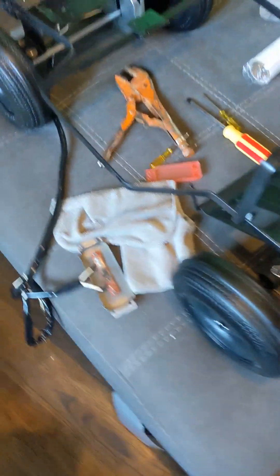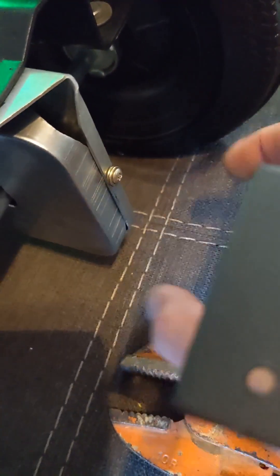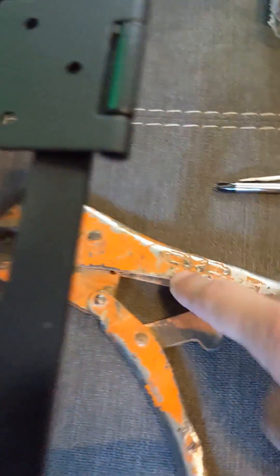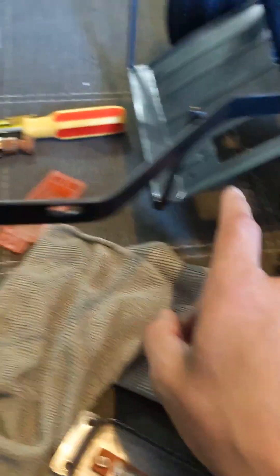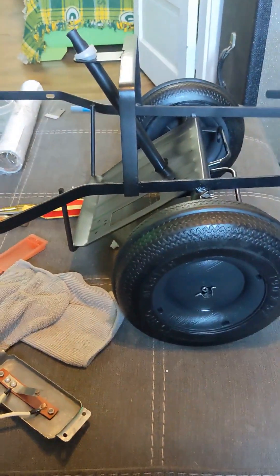Welcome back — it is coming back together. I had to take this screw out and I actually stacked a couple of lock washers and tightened them together so they would line up, and that way the screw is not close to the gear. I checked the bottom screw and it is way far off from the gear so it will be able to spin. Putting that plastic spacer in between keeps things tight so the gear is not sliding off the other gear and they stay lined up really well. Now I have the wiring harness up and I'm going to get this ready to go back on.